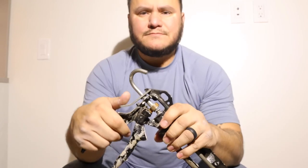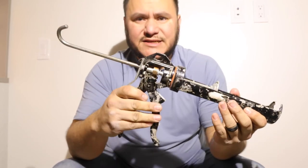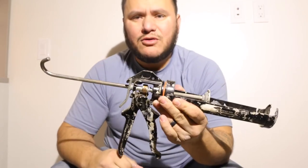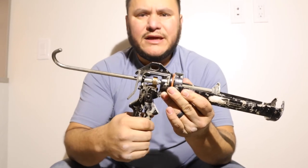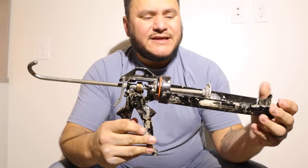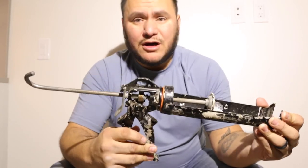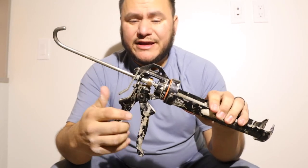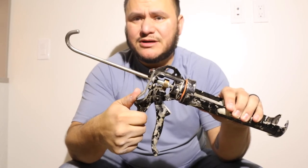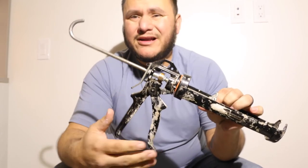What I prefer is a high-flow caulking gun. Now with every pull it gives more flow — way more flow, way more pressure. The trick to these, especially when you're shooting a small latex bead, is it puts a lot of flow. So once you're done shooting, it does not retract back like your dripless. You're going to have to remember to push the plunger once you're done or about done with your run, so that way it lets off the pressure a little bit, or you're going to make a mess everywhere.